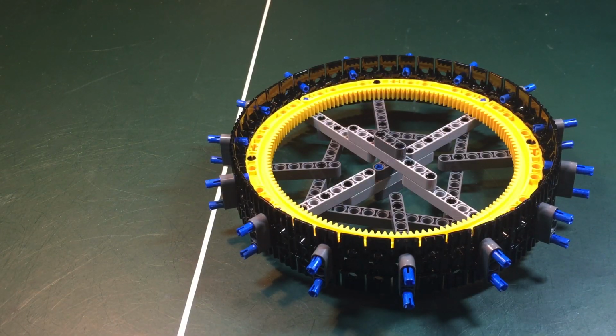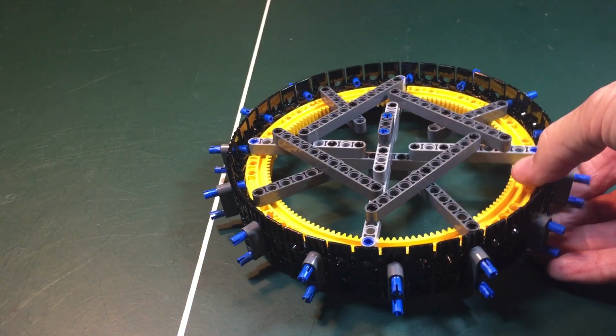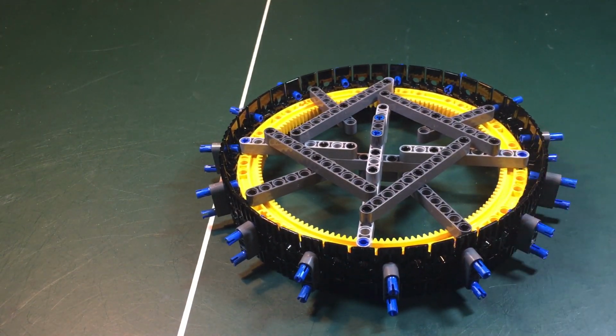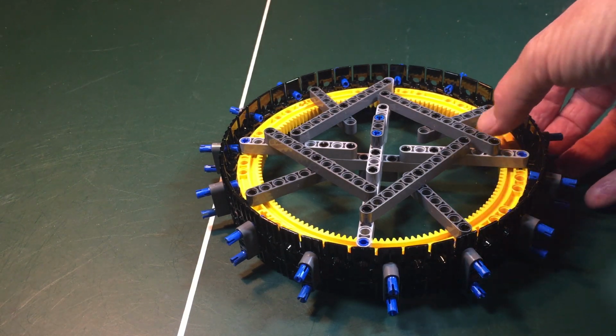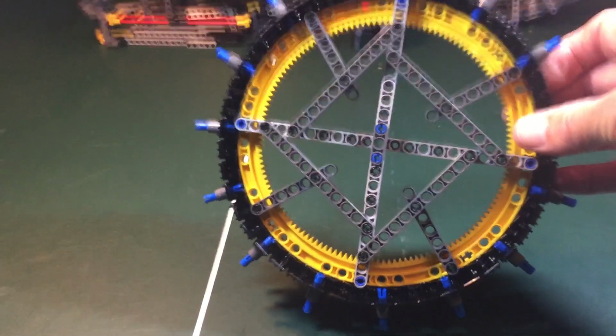There is more to the Ferris wheel design than simply wrapping track around it. The quadrant part of the turntables flex, and the weight of the pool balls causes the wheel to want to lose its shape. If that happens, the cog that meshes with the wheel will start to skip under load as the distortion opens up the gear teeth. The wheel therefore needs substantial bracing to ensure that it resists distortion under the weight of the balls.